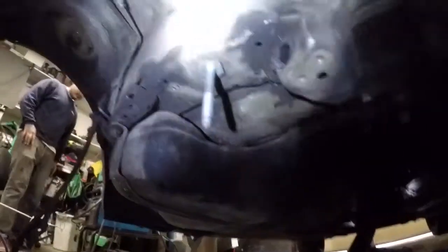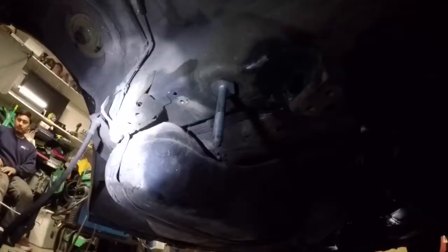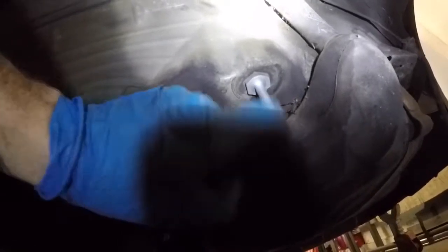The main concern areas are the main carrier, which are right here. Most of the time you'll see them and they'll be all destroyed and cracked — cracked all around the front side of this. So we're going to build a plate that comes out all the way around to this, back over and back in, on both sides, same thing.